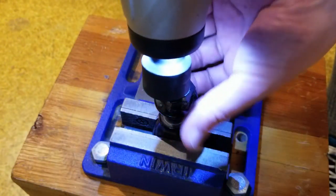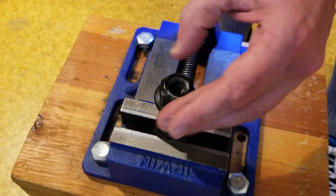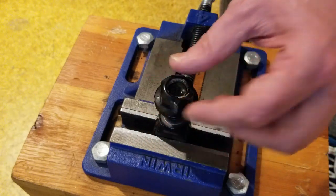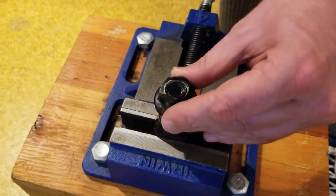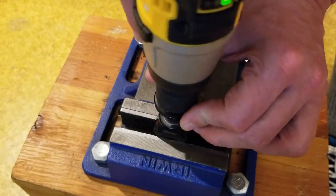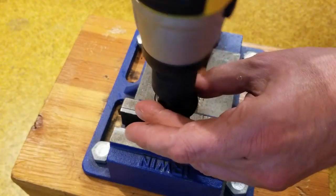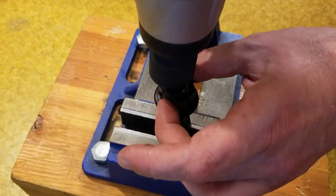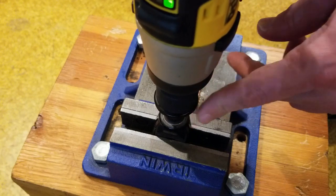Here's an example of precision mode. This is a freewheeling bolt — pretty large, a 24mm or 15/16 — and it's a lock nut pinched at the top, so it runs smoothly until it hits that pinch point. It's meant for run-up: when attaching something, you should be able to run the bolt in, and as soon as it gets snug it'll impact a few times and then stop. If you don't let go, half a second later it's going to deliver full power.